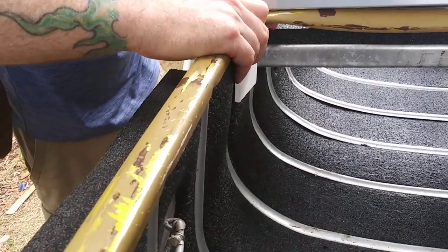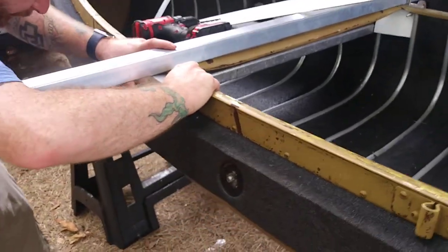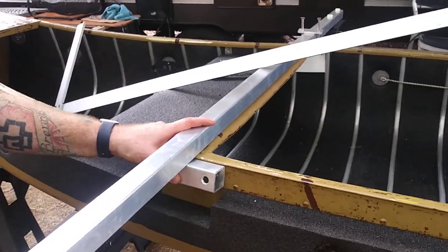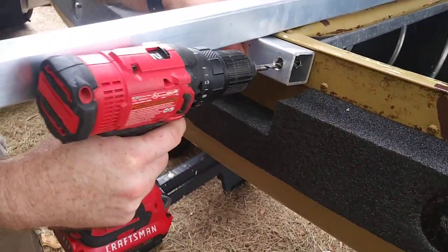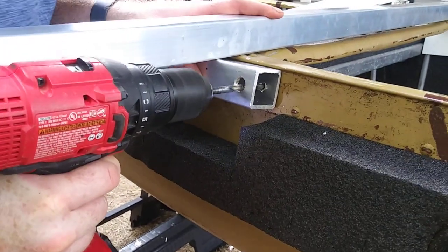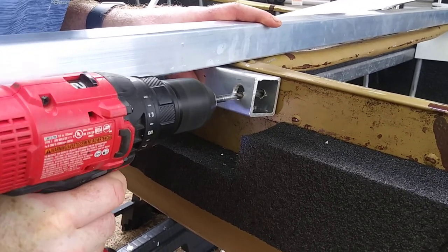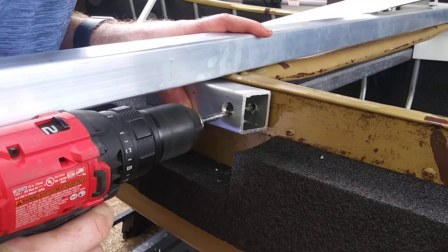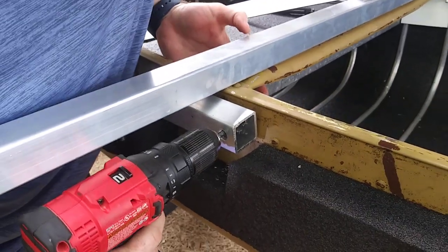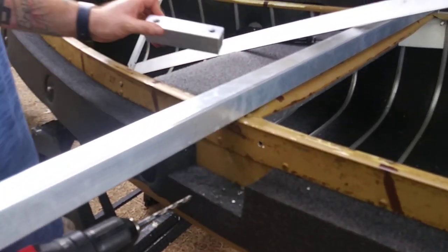He's just squishing that in place, lining it up to make sure it's going to fit. We have made sure that the boat is square, which is pretty easy to do with this boat because it has the cross tube that's already there. He's finding the hole to drill through — it's an aluminum gunnel, so we're not using the compression plate on the outside of this boat because the aluminum gunnel is just so stout that it's not needed. If you have a lightweight plastic canoe, you definitely want to put the plastic compression plates on the outside.